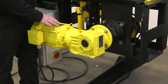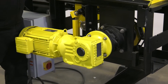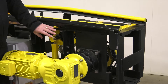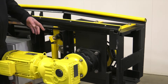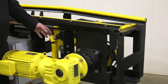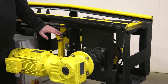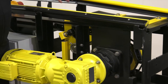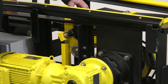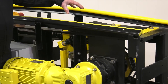We also have a visual inspection on the safety door and the safety mat. This is the XR1000; the RG440 has a slightly different configuration, but it's important to lubricate the bearings and inspect the safety door to make sure there are no cracks or broken welds. Inspect the stops and make sure they haven't worn through and that the system is intact. It's also really important to make sure your exit safety plate on top of the conveyor is in place and sound.